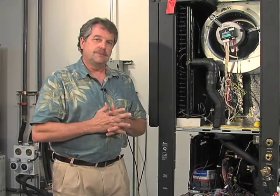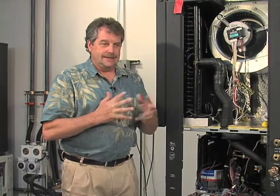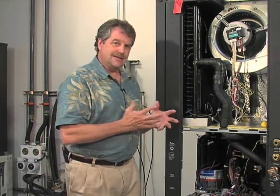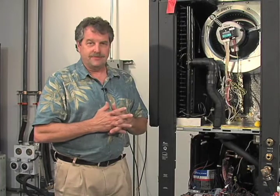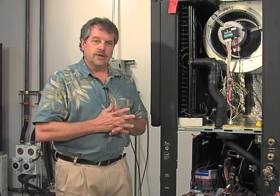One of the other common mistakes that we see is that oftentimes you will have a homeowner that has a high electric bill. Turns out that in most cases, it really isn't the machine, it's that they set their humidity level far too low. So try and keep it somewhere around maybe 50%. That's a good neutral humidity level, and you'll get good savings.